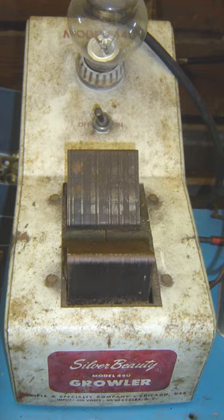Along with the standard application, the growler can be used to test series and interpole fields from a DC motor, to determine phasing and polarity in multi-winding armatures, to test rotors in rotating frequency changers as well as in wound rotors, to test shorts between turns in taped coils before installation into an armature or a stator, as a low voltage isolation transformer, as a high voltage autotransformer bucking or boosting for numerous tests on various types of equipment, and for preheating or baking armatures and rotors.